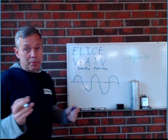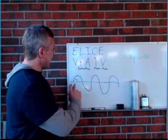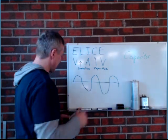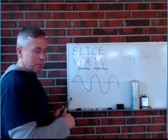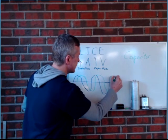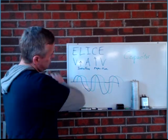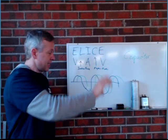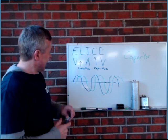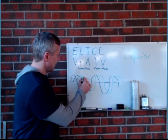So, why do we have the capacitor bank in the tanning bed? Well, when you have this inductive load effect from your choke ballast — voltage with the current coming in 90 degrees later — if you add a capacitor on the load side of this choke ballast, that has the opposite effect, then you would pull back that phase shift, centering it back to zero on your service.